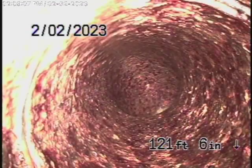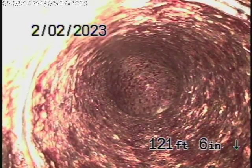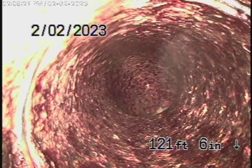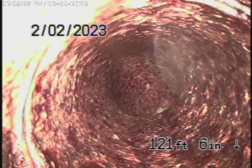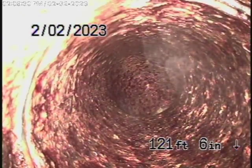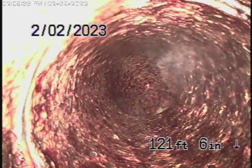We're going to come out of the clean-out over here at the end of the driveway and run our camera upstream. We're running the camera from the 4-inch clean-out going upstream, which actually took us all the way out to the pool house. This clean-out goes all the way to the pool house. I did flush the bathrooms over here and this little section came by. We're all the way into the little cabana over there where the little bathroom is. That's the end of the line.